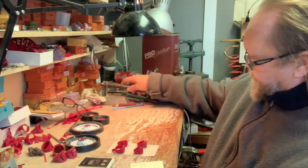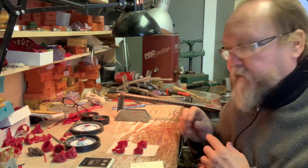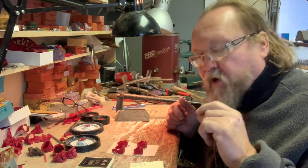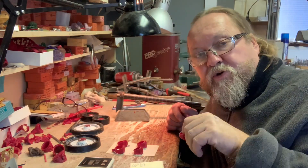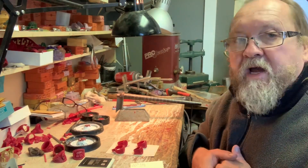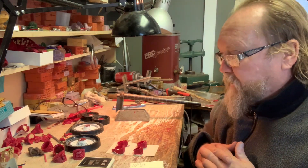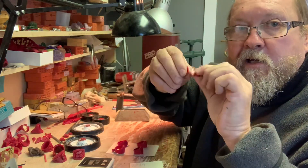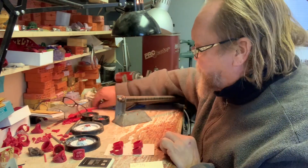You should deal with them right after you take them out of the mold, because they're the warmest and most pliable. But I have the steamer on and the ultrasound tank on, so I'll just drop this into the ultrasound tank for a few minutes and the wax will become very pliable — it won't be brittle. Like this wax here — see how it broke? So anyway, what I wanted to show you now was spruing.